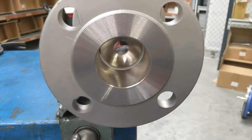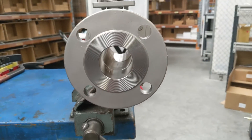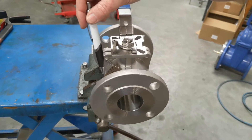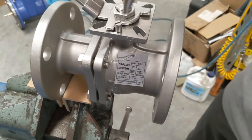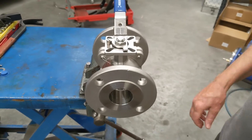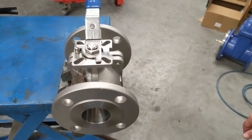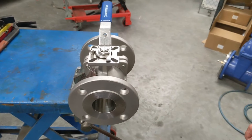You can see the ball inside here. This has PTFE seats and a two-piece body. It is API 607 certified — if you look at the tag, it also is lasered onto the body. The certification covers temperature ratings for general purpose and steam applications up to 180 degrees Celsius. The fire-safe certification makes it suitable for petrochemical and other applications.